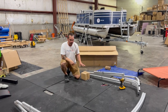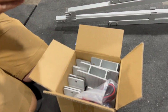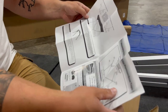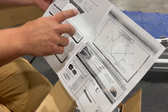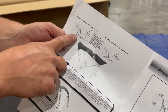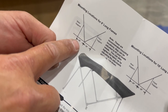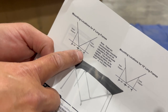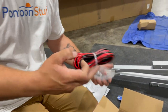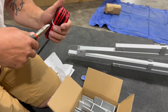Back to our hardware box. Now we've got everything laid out oriented how it will go. Let's open this up. You've got your instructions — pay attention that it's going to show you your inch and a quarter bimini frame, but we really need to look at the mounting locations for eight foot long frames: 34 inches from the stern support to the middle support, and 38 inches between the middle support and the front support. We've got an electrical bag here with some hardware.